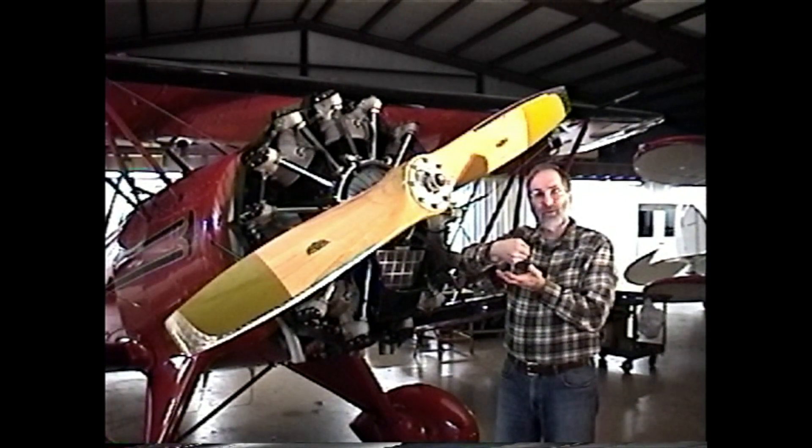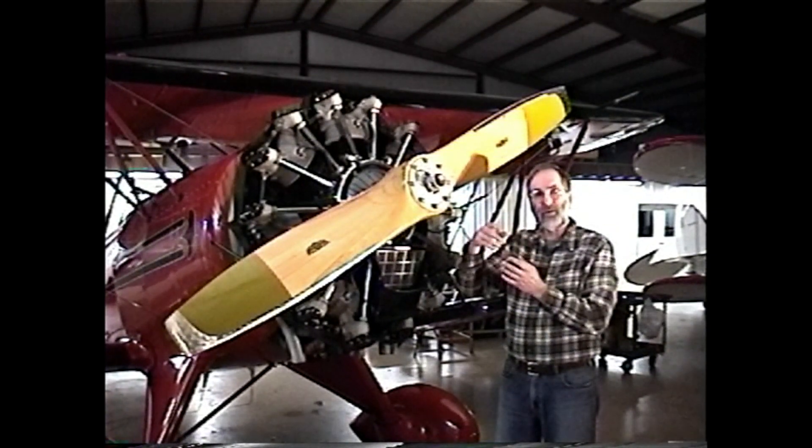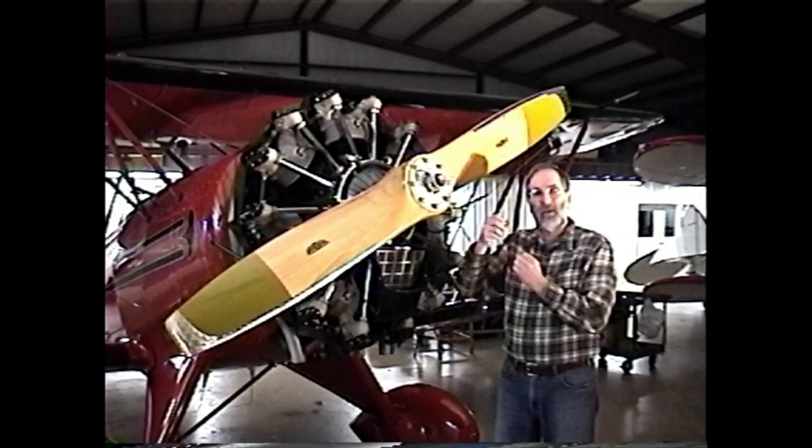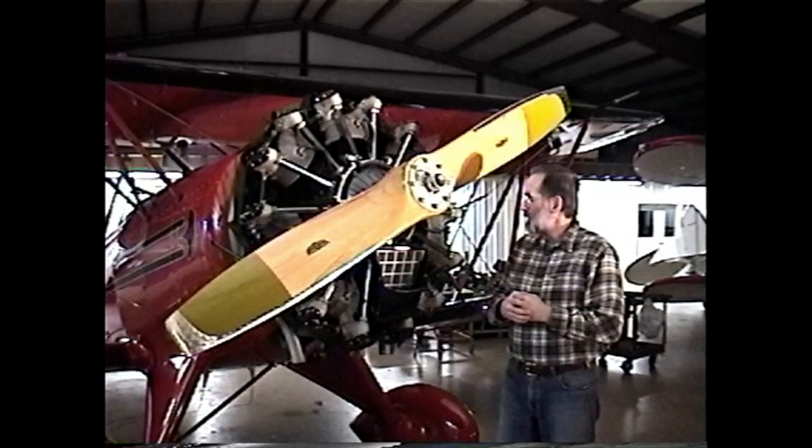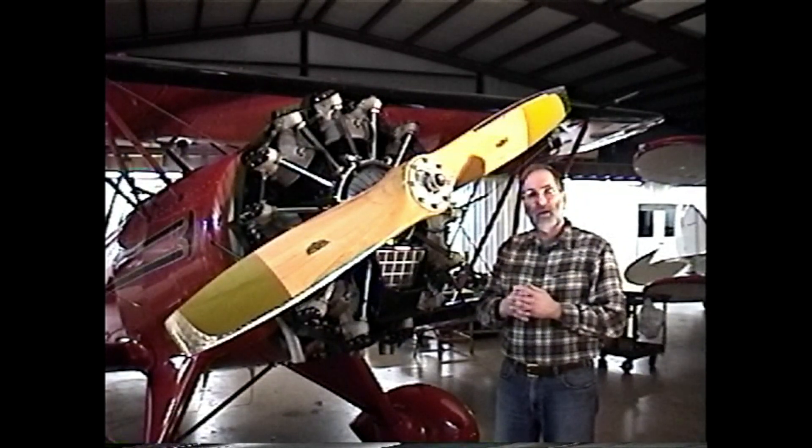The engine does not have the force necessary to compress that oil. So something has to give, and that something is the link rod in the engine. The link rod almost always bends during a liquid lock, and sooner or later that will cause a failure in the engine.